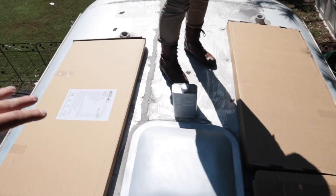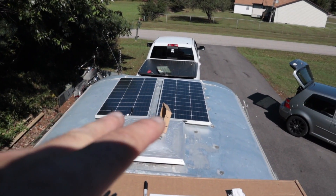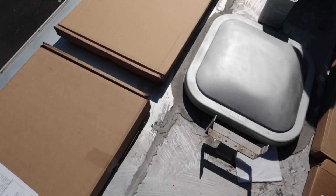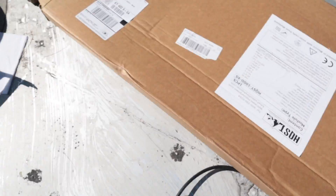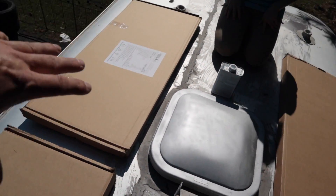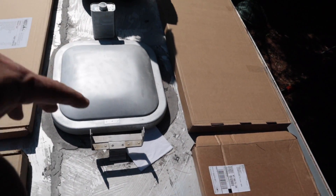Planning the wire routing: wires facing together on each side, one junction box up top and one down below, then connect the two and run it all the way to the middle where the main junction box will be. We may move the panels up a couple of inches to match the other set. So two panels feed from each side and meet in the middle at the junction box — that's roughly how it'll go.